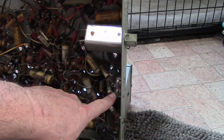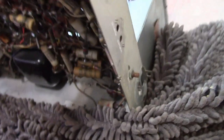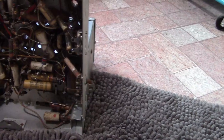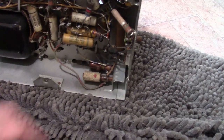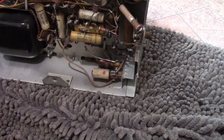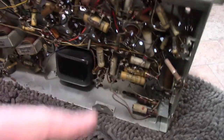This is going to be your horizontal drive, and maybe a coarse horizontal frequency or horizontal lock — they call it horizontal frequency lock drive. Many sets use that. Admiral used two adjustable ceramic trimmer caps — definitely worth saving. And then down here we have a width coil and a linearity coil — save those. They're just hanging out in the open so they easily get damaged; if something goes bad in the horizontal circuitry these can burn up. Lots of sets use very similar ones, so they'd be compatible with a lot of sets.